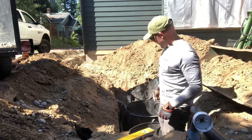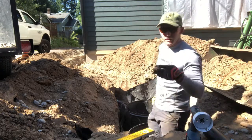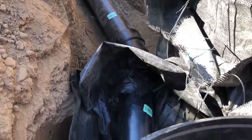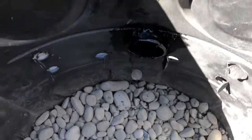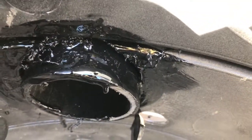Before I glue that up, I'm going to pull it back out and just X in that fabric and slide the pipe through the fabric so we have a little protected area. We've got the pipe coming in from the ditch and into the side of the first bin. Make sure that your second pipe connecting the two bins is a little bit lower than the inlet from your first pipe.